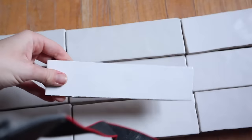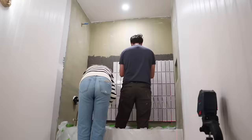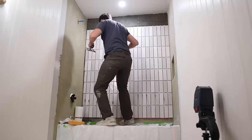We organized the tiles into neat piles and then Christian got to work tiling the next day. We also used the handy tile cutter, which wasn't helpful for floor tile but was great for this type. Christian was able to cut as he went, so all the tiles were easy to lay. I didn't do much during this process — I'm normally wrangling toddlers — but I did step in with a wet sponge to clean up thinset. Unlike the floors, there wasn't much to clean up. This was a very straightforward part of the project.